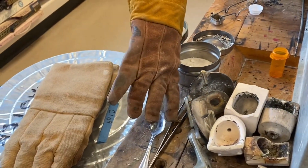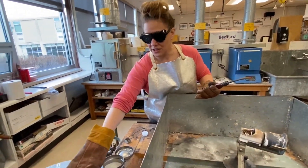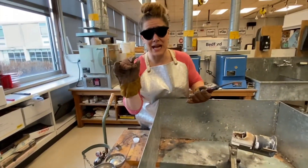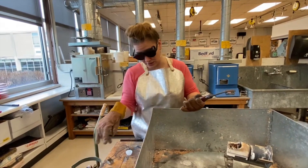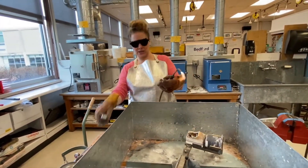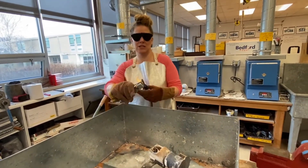As students, you'll take the tweezers and put one piece of metal at a time into the crucible to get the full weight — it's easier starting with half. You'll also use this spoon to put a tiny bit of borax into the crucible when asked. We do not want a whole spoonful — it's maybe a quarter of what the spoon holds. Now I'm going to turn the gas on and light the torch.